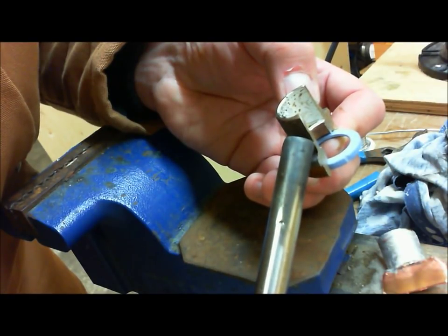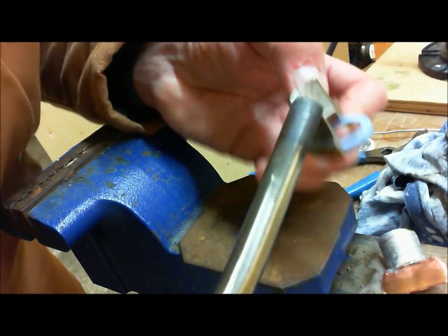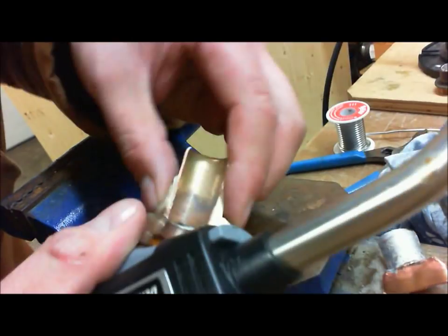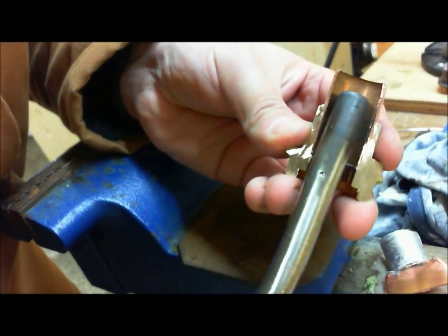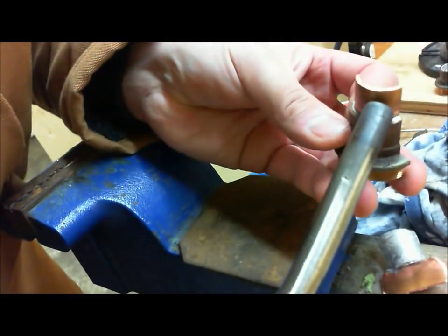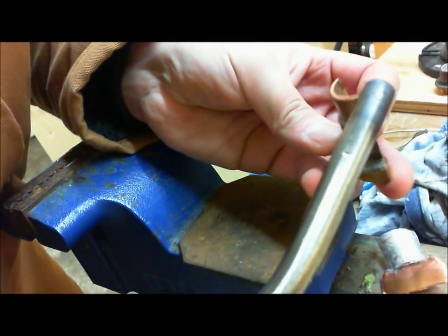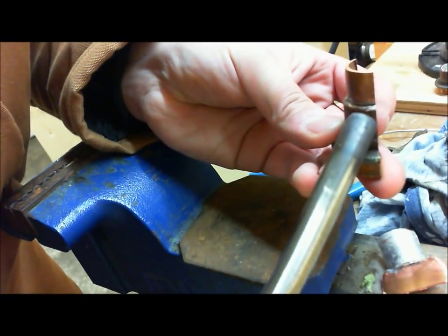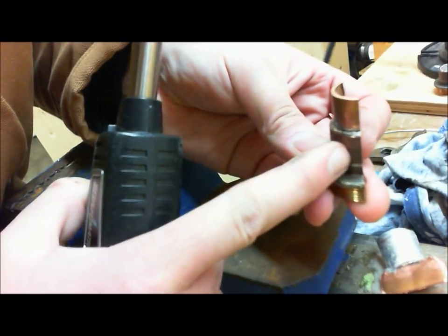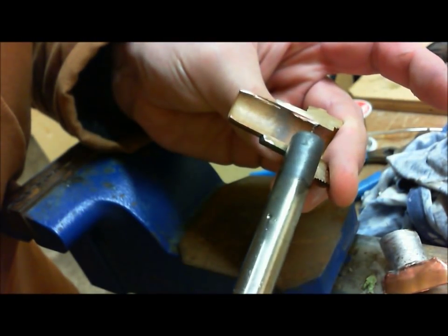But people think, well, if I'm doing that, you probably can't get it. Well, that's the second tip. Because you've got this copper tube in there, use the copper tube. If I put the heat on the copper tube here, that heat where I'm applying it right now is going to go all the way down to here. So that's why you do a combination of the socket and the tube. You do both. Socket here, tube here. And if you do both, the heat is going to go all the way down.